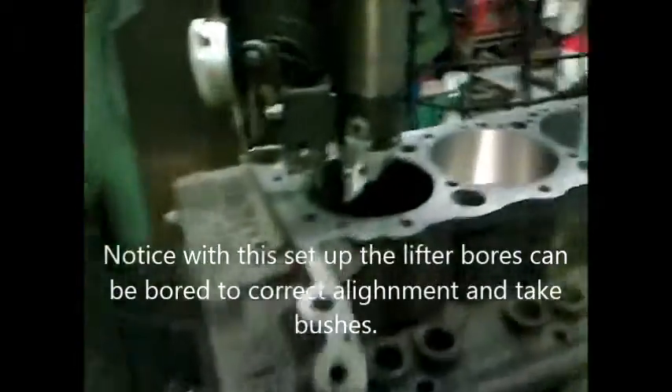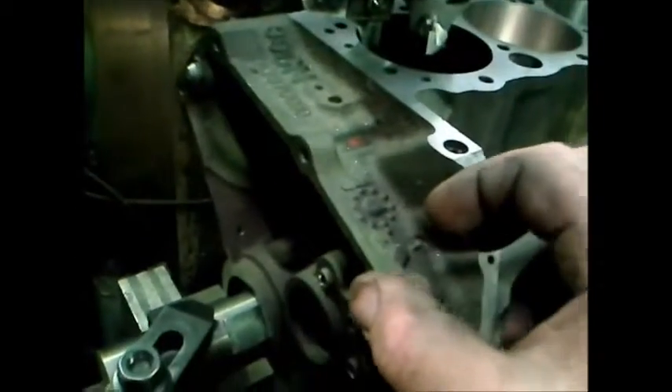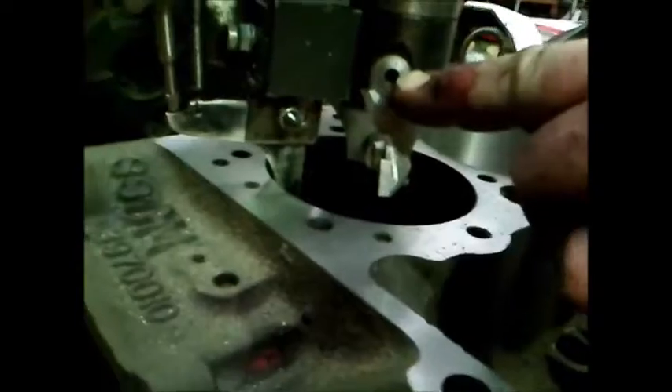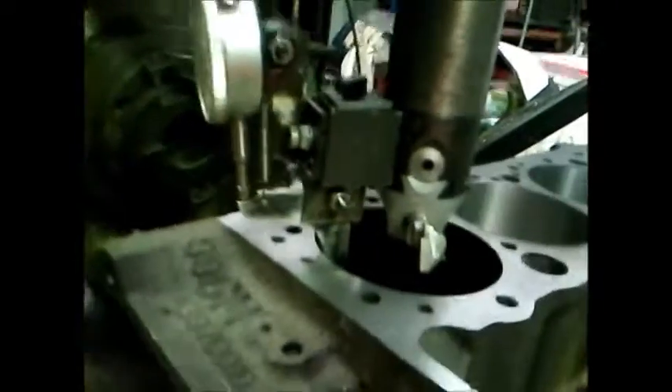On a lot of production boring machines, they use a tool where the tool pops out, you set it on a direct reading micrometer and then pop it back in — but it's always scary, you never know where the thing is going to bore. What I've got here is just a pretty standard boring head. What you can do is take a small cut, measure it, and say 'all right, I'm 12 thou away.' So you give it 6 thou on the dial here — that winds the whole tool out 6 thou, which will give you 12 thou extra cut. And away you go.